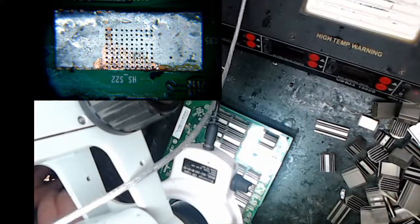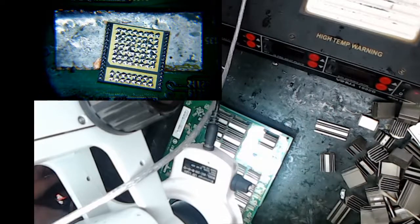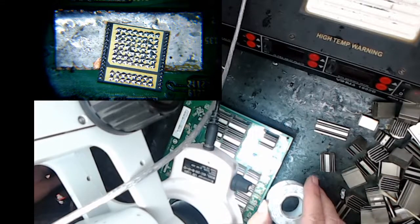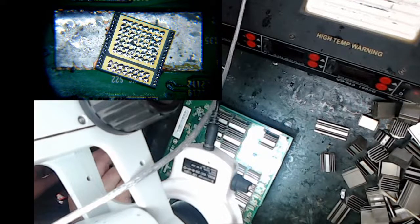I have very little solder on the chip, so I'll show you a brand new chip I've done. That's how much solder's on the chip. And if you wick the base of all solder you can, there's just not that much solder touching it. It's enough to make a good connection. I hope that answered your question. Do you see how much solder is tinned on the chip's legs? It's not much. When you push the chip down, it pushes out to the side, which makes those balls. You shouldn't be globbing on solder. It would be way too much solder. So I haven't had that problem. Now, I've worked mainly solely on the 17 series, so I don't know if it's a problem on an S9.